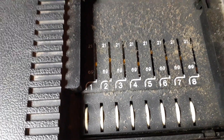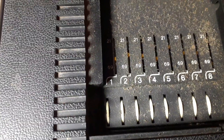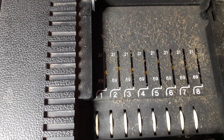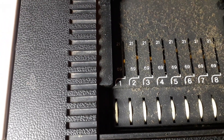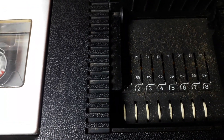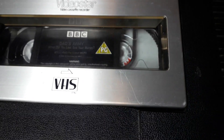You can see the original dust, and you can see all the settings for analog TV reception. I remember ITV was channel 23, BBC One was 26, Channel 4 was 30, BBC Two was 32, and Channel 5 was 37 — which caused a lot of problems with people's game consoles and other devices being tuned to similar frequencies.